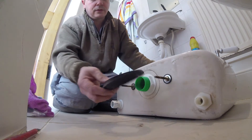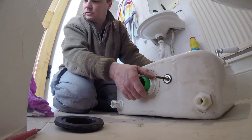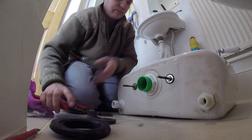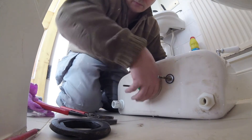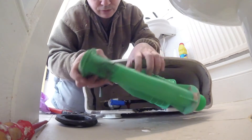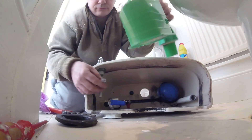That's the old washer that seals between the cistern and the toilet. You need quite a big set of grips to get this off, and then once you release that big nut it's pretty straightforward just to undo it. Out it comes - it's still attached to the handle there, but with that loose it comes off nice and easy.